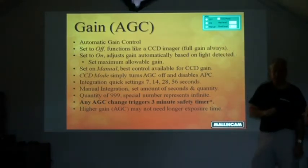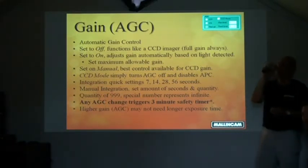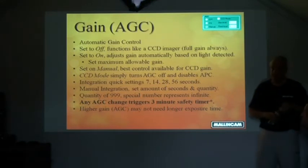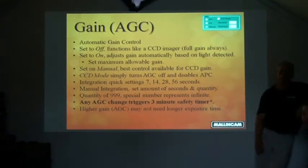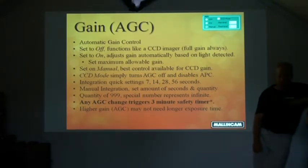Okay? So I'm confused. How do you turn AGC off where you don't have AGC on? Manual 0, right? Manual 0. That's zero gain. All this time I'm putting AGC off. Off is AGC full. Wow. And if you set yourself a preset where everything is set up and you have AGC at 0, then there you go. Done for you. So completely off is manual 0 at the fixed level. Manual 0 means your gain is 0.